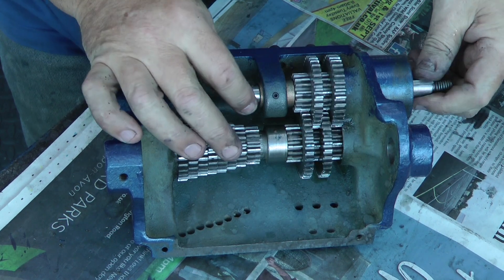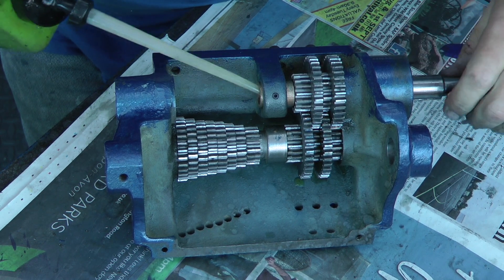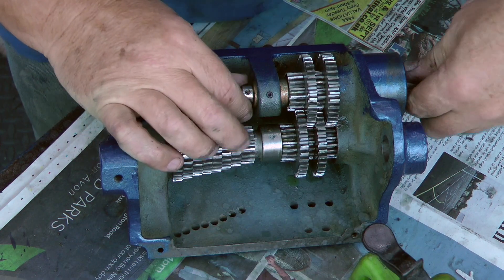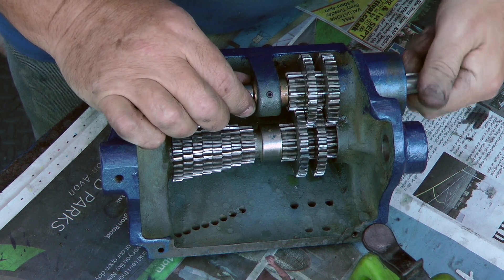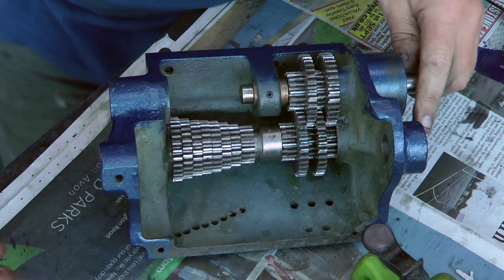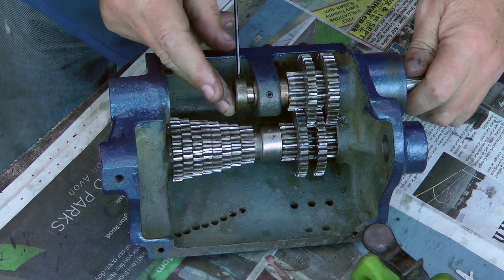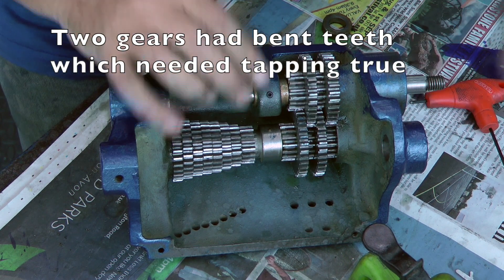Just feel the keyway - there we go. Lovely. Just drop a bit of lube in this bush, between the gears. Let's put it back in. Let's feel that keyway again. Now it's doing this before locking as if the shaft's bent. So this goes on here and locks on there - that controls the thrust on that. I'm worried about these tight spots here, let's investigate that.